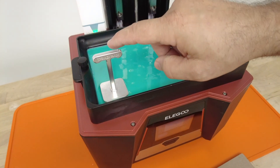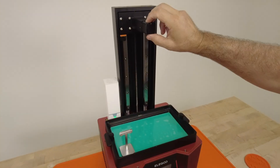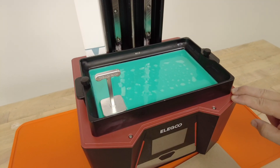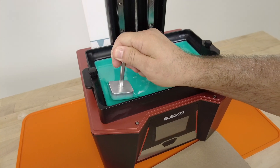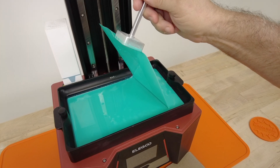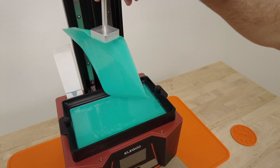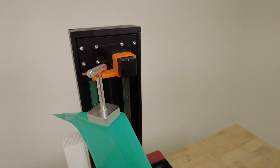If you'd like, you can usually hang the vat top on a lot of different build plate holders, or you can use a simple 3D printed model to do that. Once the vat cleaning is done, you just want to lift this up at an angle and peel. What we've just done is removed everything that was in contact with the bottom of the FEP, doing a really effective FEP clean. If you'd like, you could hang that right there and let it drip dry.